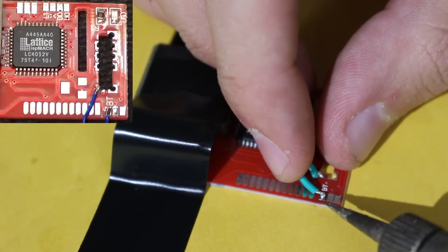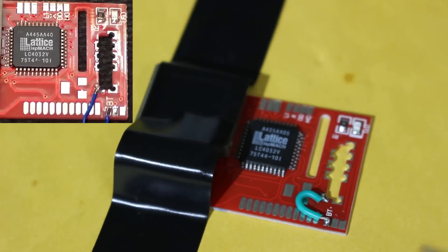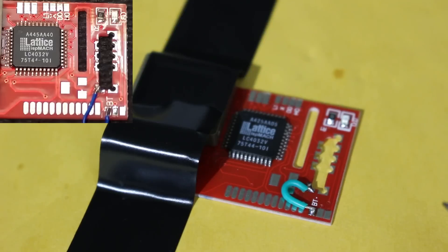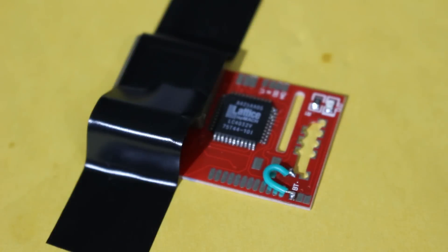Go ahead and check your wiring and check your soldering. Make sure that's not moving around too much and it doesn't get loose. If everything's good on that, great — that is really all the work we had to do on the chip itself, so the rest of this is now going to be on the Xbox console.